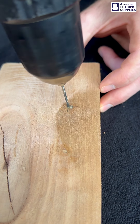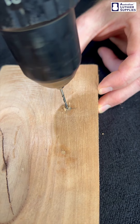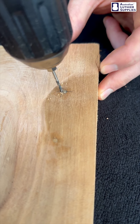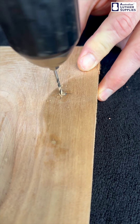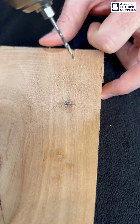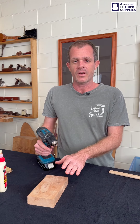That's a pretty good start. I'm actually tilting it a little bit towards the main part of the wood because it's wanting to go to the outside of the plug. You can see I've got it on a fair angle there but it's maintaining that straight path in — and there you go. It's stuck right to that cross, and if you were to put a screw in there it should follow into that new hole. So that's how you can put a new screw hole in when you've got one that's slightly overlapping.